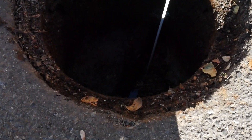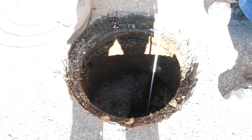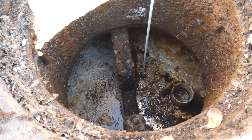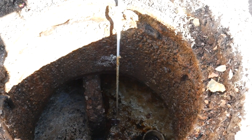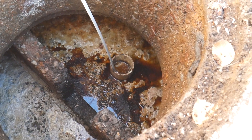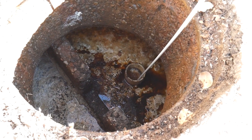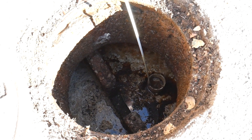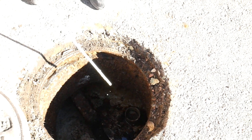To assess the grease in the first chamber, Nick inserts the probe into the grease trap as straight as possible, perpendicular to the surface, until he feels it touch the bottom. He will tap the probe along the baffle wall to ensure there are no missing sections and then hold the probe submerged for a short time. This allows FOG to accumulate on the probe and gives an idea of how deep the FOG layer goes. He will then remove the probe and clean any FOG stuck to it. He will then reinsert the probe into the transfer pipe on the baffle wall, again probing to make sure the connection pipe is intact. As he removes the probe, you can see that there is very little FOG clinging to it and mostly water dripping off, which indicates the grease trap is working correctly and very little FOG is passing into the second chamber and in turn the collection system.